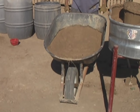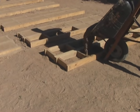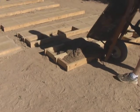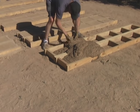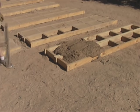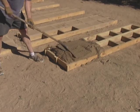If we go more than half a wheelbarrow, it's too heavy for our volunteers and we risk tipping them over. The wheelbarrows go out into the field, and we start on one end of the form and dump the mix in. There's a little hand work to manage any spill on the sides. Notice how wet the mix is. There are two ways of making adobes — a stiff mix where you pull the form right away, or this wet method where it's not possible to pull the form right away.